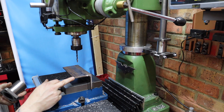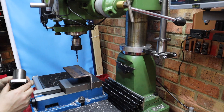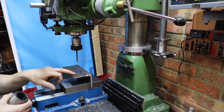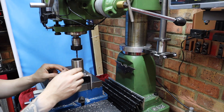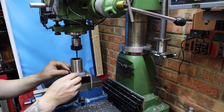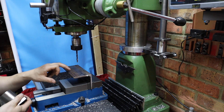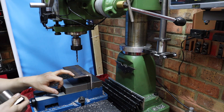I want to use the three inch angle iron to brace between the upright and the head. To do that we need a way of attaching onto the bearings. I've laid out the bearing on here, drew around the holes and made a mark out. My plan is to mill these as elongated slots so when it's in place I can adjust it side to side to get the fit perfect. I'm going to start with drilling out these 6mm holes, then elongate them with a milling bit to make it easier on the end mill and not wear it out as quick.